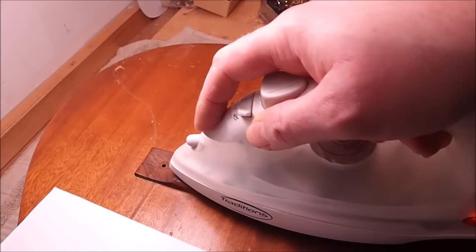Using a cabinet scraper to shape the bottom of the bridge, make the arching, and also very lightly relieve the interior portion to a depth of maybe a thousandth of an inch so that it makes contact around the perimeter first when I put the clamps on. Then I'll grab some sandpaper. This is an operation they didn't spend a whole lot of time on in the 60s at the Harmony factory, so you can be kind of philosophical about how much sanding you want to do. I do want it to be smooth, and I'll also break the edges around the corners to make it nicer to touch. I'm going to apply some polymerized tung oil to the edges and the wings of the bridge at this stage — I'll try not to get it on the top of the bridge because I'm going to put a piece of tape on there when I mark out for the intonation lines, and the tape won't stick if it's oily. What it does is act like a resist so that when I glue the bridge on, it keeps the glue from sticking to the sides and makes cleanup easier.